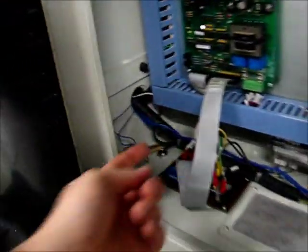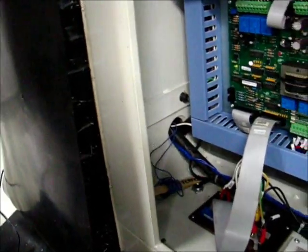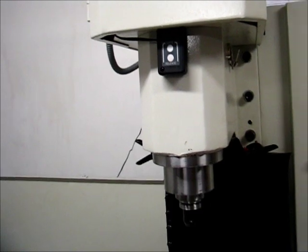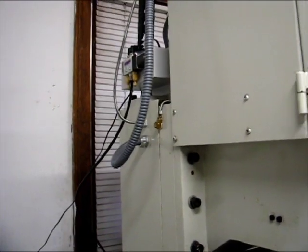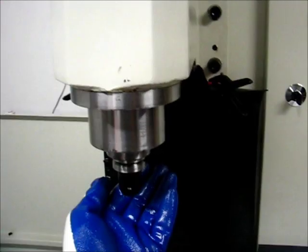The wiring is complete at this point. The only indication that this wire is even in there is where it comes out of the column and into the wire routing material. Everything's reconnected back the way it was. Compressed air is going to the manifold and the mill is off, but since the power drawbar is powered separately, the power drawbar works like it should.